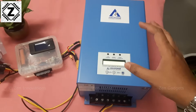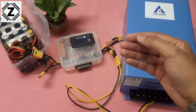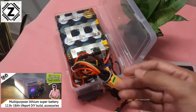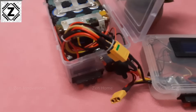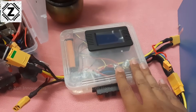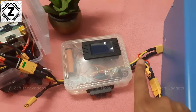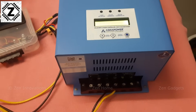To help with this kind of situation, I have decided to do a live power consumption test — that is, the idle draw or standby power consumption test on this Asha Power MPPT. Here I have connected my home-built, hand-built lithium ferro-phosphate, that is LiFePO4, battery. The specification is 12.8V × 18AH. The power flows using XT90 connectors, first going into this PZEM015 DC energy meter, which is really very accurate as we found out in previous videos. Then using additional XT90 connectors it goes into the Asha Power MPPT.